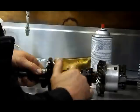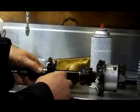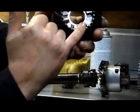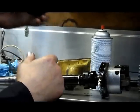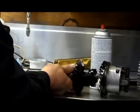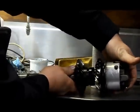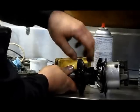You can see that the clutch dog rides on these splines right here, and the clutch dog is engaged into the gear, into the prop shaft. If you look at these cogs right here on the clutch dog and you look at these in here on your reverse gear, you'll see that they have intersecting points. So when you shift into reverse, this actuator shifter is pushed down, the clutch dog moves toward the stern, and connects with reverse gear.